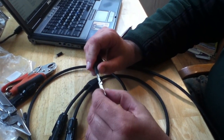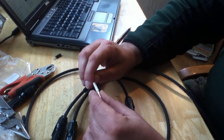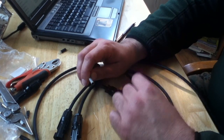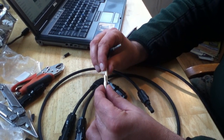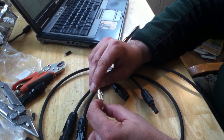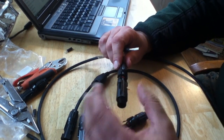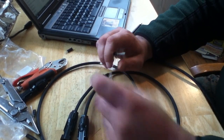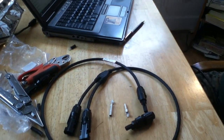You may need a different head assembly capable of taking thicker cable but that still has ends that work like this. When placing the inner connector on the shaft — we've got a male-female side here — you want to make sure that the wire doesn't go up the center so far that it's going to interfere with the plug-in. There's a limit on insertion depth to ensure you can plug these in all the way. If there's any blockage these things won't click right. Crimping depth is more sensitive on one side than the other.